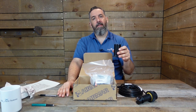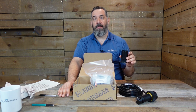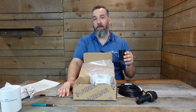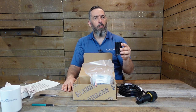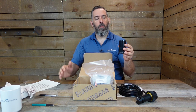If you're putting a transducer on your boat, you're going to want to check for leaks — at five minutes, 30 minutes, an hour, three hours, six hours, and 12 hours later, constantly looking for a leak. You don't want to put a transducer in your boat that causes it to sink. It's okay to worry at the beginning — once you've done it for a day or two, then you don't have to worry again.